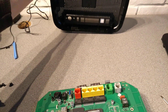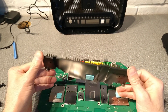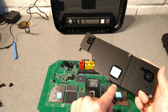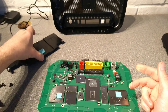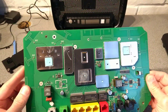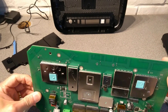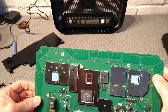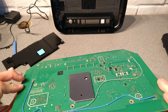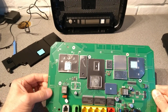Let's move the clamshell out of the way. This is what the back of the heat sink looks like and the front of it. We've got three thermal pads — one there, one there, and the final one over here. These blue things are taking radio from one side of the board to the other. This blue one over here ends here, goes onto the connector on this side, takes the radio over to the left side of the board, and goes onto this PCB antenna there.